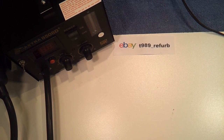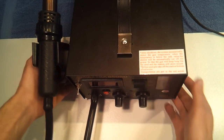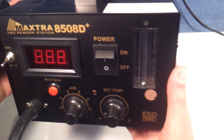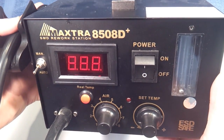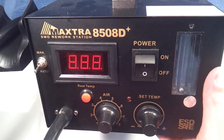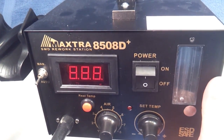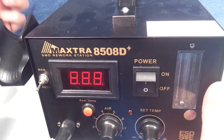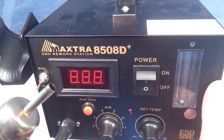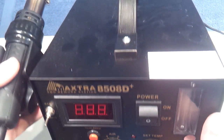What is special and what we need to talk about here for a moment is this unit here — this is what they call a hot air reflow soldering iron. You dial in your temperature with this knob and adjust your rate of air flow. You want to set it so that you have enough heat coming out, but you don't want the air blowing so quickly that it blows the small parts off of your board. The hot air comes out of the nozzle and it melts your solder — that's basically how this unit works.